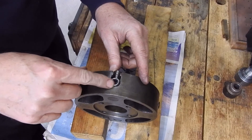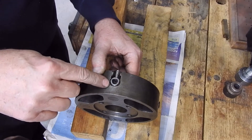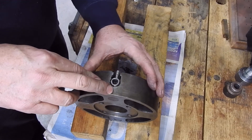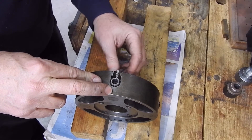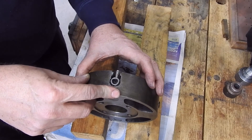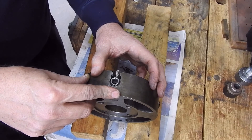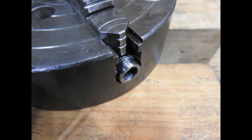So there it is — it fits, it doesn't bind up, it works quite nicely. Really it's going to be one of those 'time will tell' things, whether those welds hold or whether the whole thing collapses. I certainly wouldn't recommend it for hard use, but from my understanding this is going to go onto a tool and cutter grinder — there shouldn't be any large loads on the chuck, so I don't think it'll split again. I've put grease on and wiped off any exposed excess, because you don't want metal dust collecting in your grease. Thanks for watching — I hope this has been of interest.